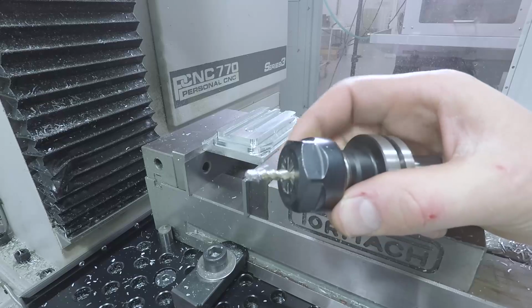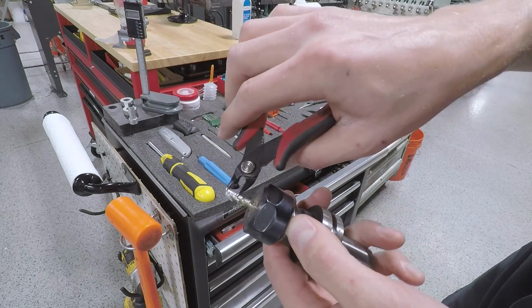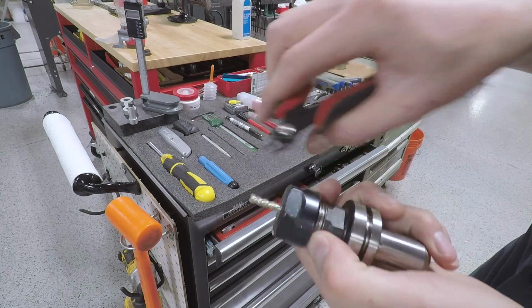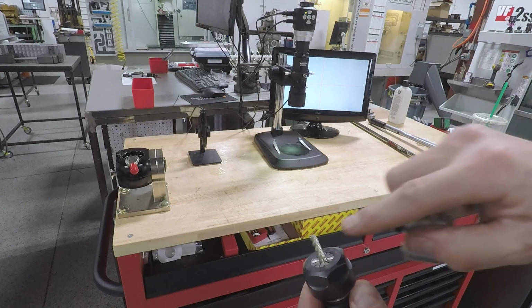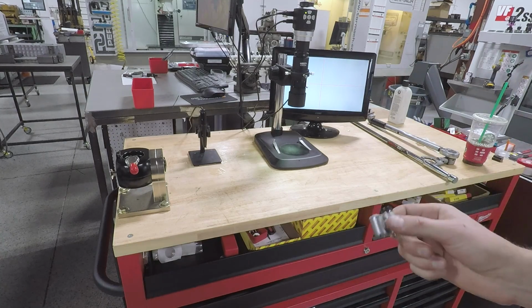So we do like using these tools. A lot of times we are able to actually squeeze the aluminum chip and have it sort of peel out and not damage the tool, but we need to take a closer look because a lot of times you are going to compromise the cutting edge of the tool. Was it damaged, or is there some aluminum left that could be a built-up edge that'll cause it to chip weld again more quickly? So 3 ways to do that.